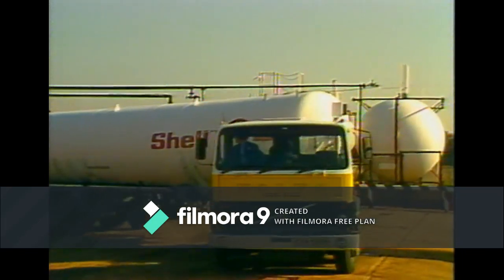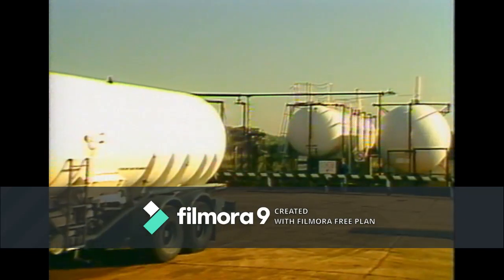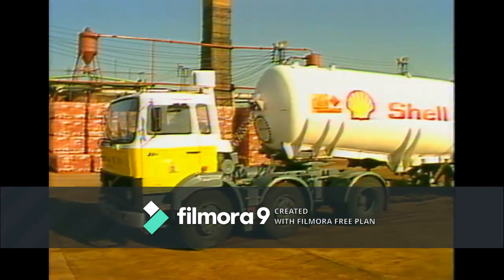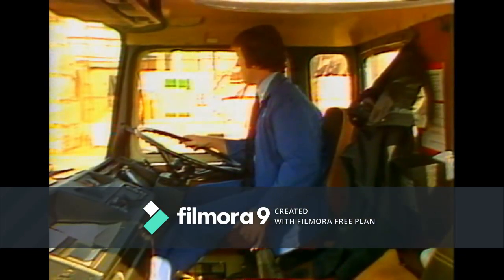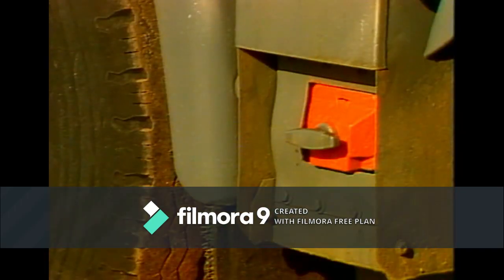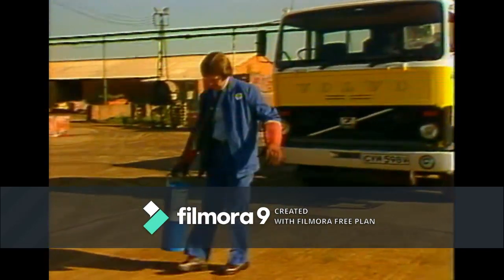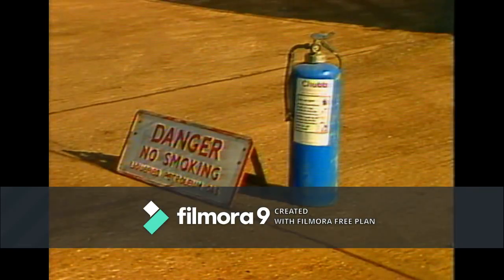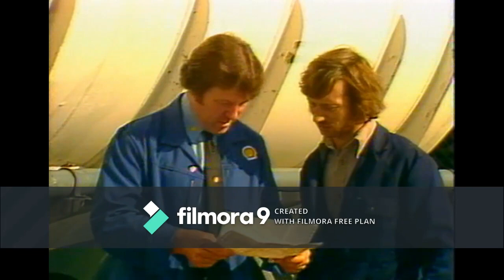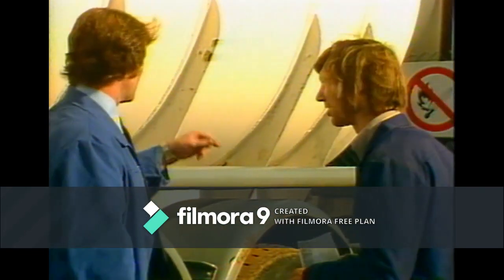When making a delivery of LPG, much of the routine is similar to that used for loading. For instance, the vehicle should be parked so that it can easily be driven away in an emergency. The customer should be contacted and his agreement obtained on the product being delivered and the quantity required.